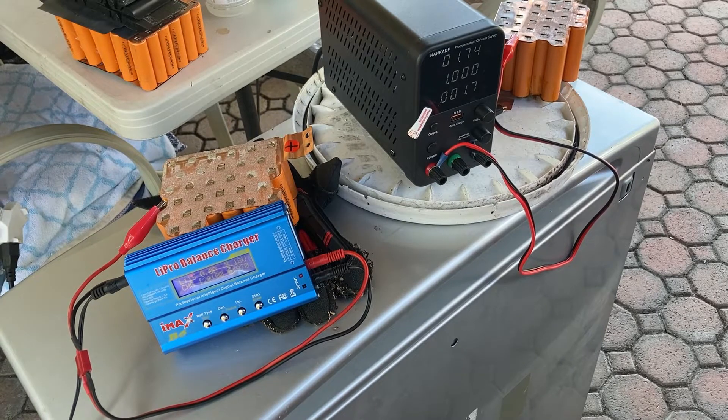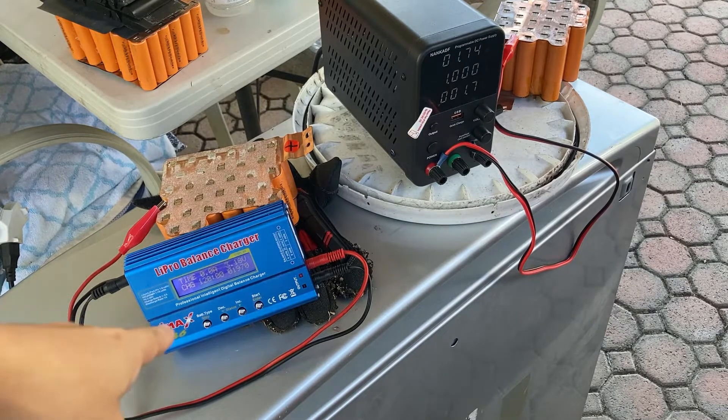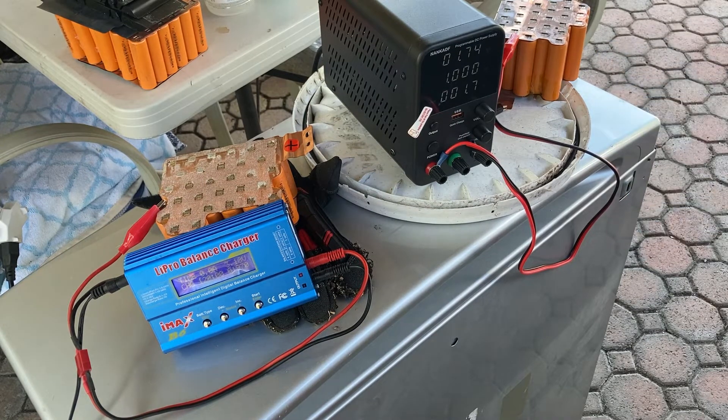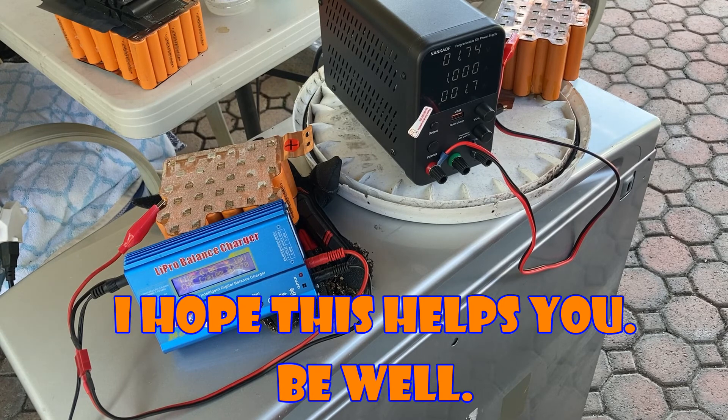Alright, here we are morning after — about nine hours. The good pack charged up to 3.18 volts, which is good. Now this one kind of stalled out at 1.7 volts. I think we could probably keep going. I can see some discoloration of the copper — I think that's from oxide due to exposure to the air. We're going to keep going: 1.74 on the left. We're going to take it out and see which cells are the high performers.